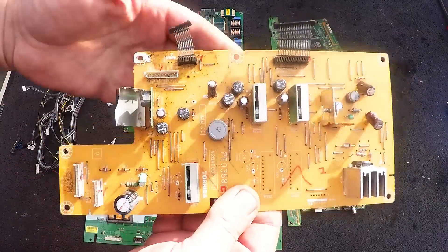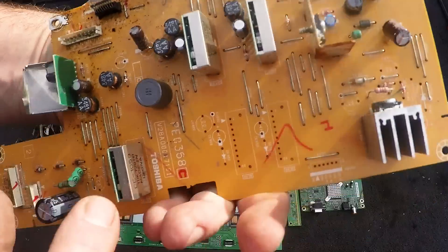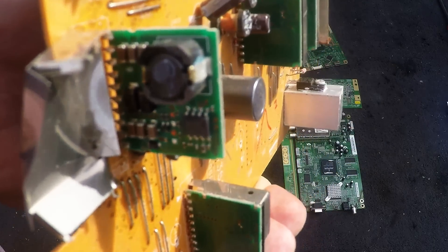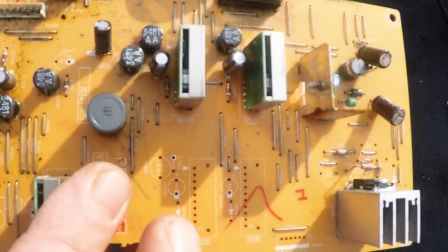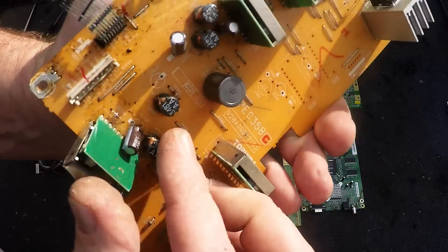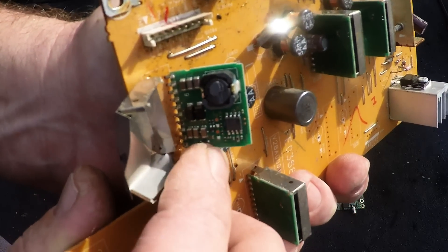Also this very basic power board — it's almost like a throw-away one, scrap steel anyway. But behind all these little shield plates, we've got little boards here, and those boards have got — you can see — 3 MLCCs on each side, so there's 6 MLCCs in there that we can get out of each of these. Normally with a low grade board you wouldn't even think to look behind these shields, but we can take off these 6 MLCCs, which is a nice little bonus.